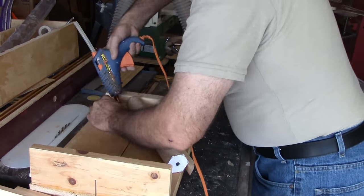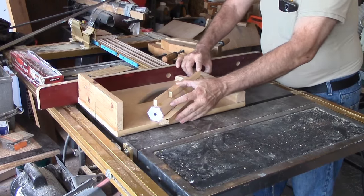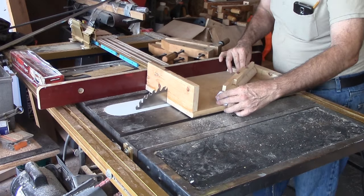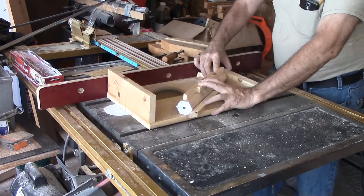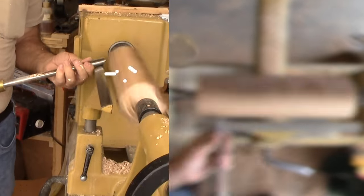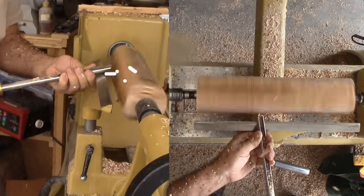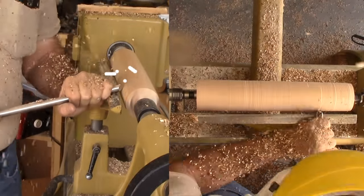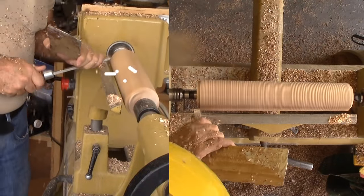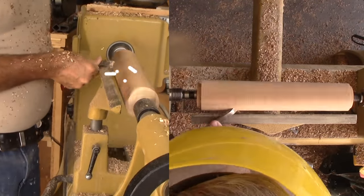Hot melt glue is sufficient to keep stops in place. After adding the top reinforcement, I make the first cut, then flip it around to cut the other end — same angles, so why not two at the same setting. Glue in the slice. While waiting for the glue to dry, I'm starting to rough out the main part of the rolling pin. I'm using a gouge for the rough part, then switch to a skew for skew practice. I'm cutting a tenon on both ends of the pin portion since I'll want to mount both ends in a scroll chuck.